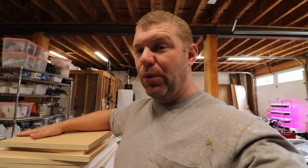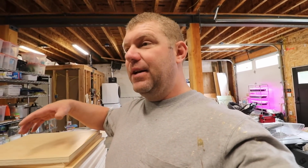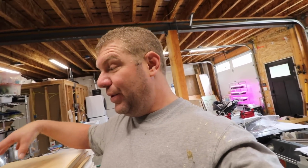So hypothetically, what we need to do is get these sorted out by the box that they're going to be made into, and then come up with a way to, well, obviously drilling the pocket holes should be pretty straightforward. We're going to want to make sure that that's calibrated and that we do some test holes first. And then we need to come up with a way to consistently hold this stuff while we attach the two pieces, because there's no alignment feature built into the pocket hole system. And I don't have any clamps. I don't think that'll do that super well. So we'll dig through the stuff that we've got and see if we can find a way.